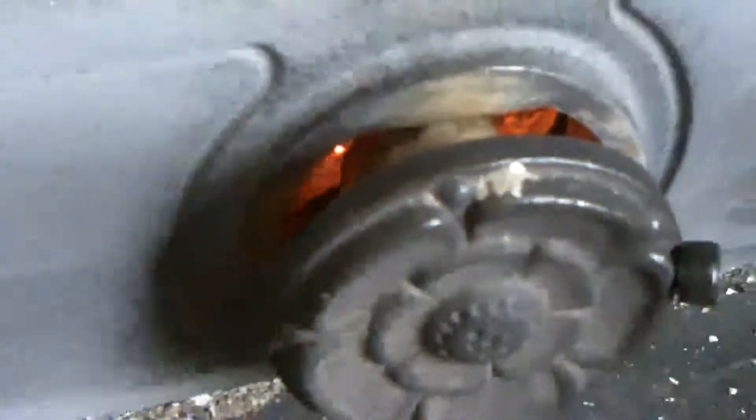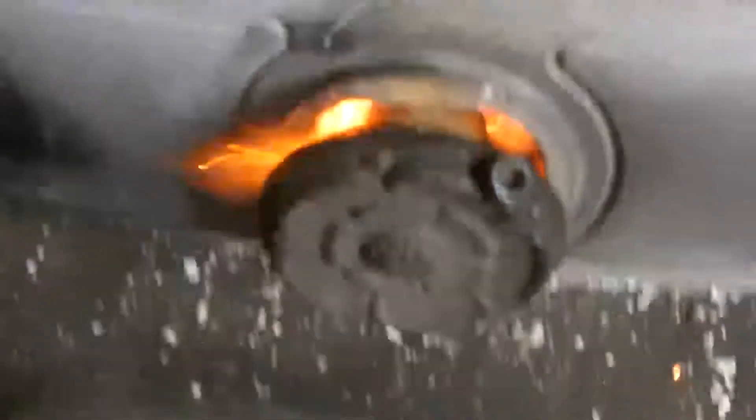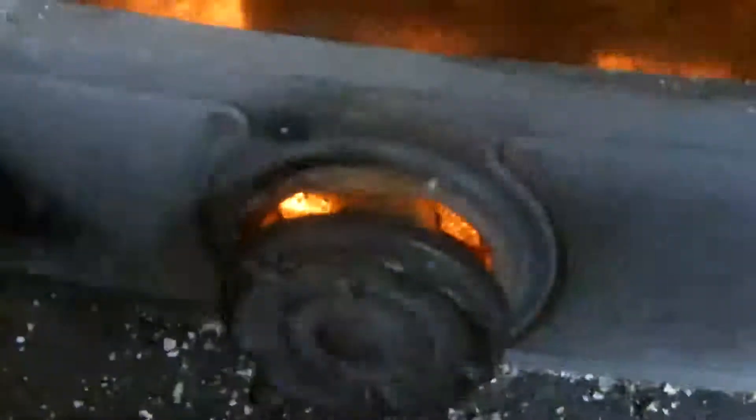The motorboat sound or purring that you can hear is the air rushing into the wood burner. Air is being drawn into the fire because the hot gases are rising up the flue. They are being drawn in and they expand so violently that they can't get out of the chimney very easily, so they simply blow back out of the vents. These two vents at the front of the fire are where the air comes in, and under certain conditions the flames are blown back out.